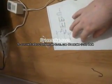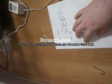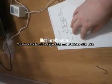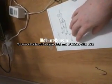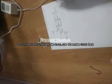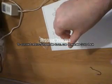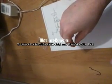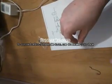To do that, you have to have a voltage source. It doesn't really matter what the voltage is, as long as you don't go too high. You probably want to go 5, maybe 12 or so, or test between those two voltages. Put it on one polarity, on one channel, and go up and down with the knob and see if it stays. One direction goes higher, but not over 1 volt. The other goes lower, but not over 1 volt. If it does that, that part's good, then switch the polarity and do it again for that channel. Then do the next channel and so on.